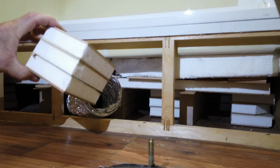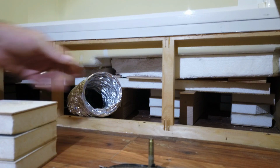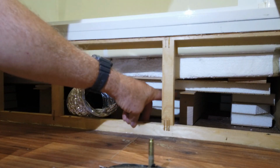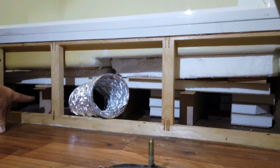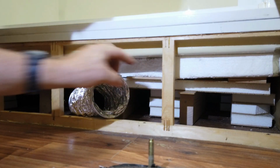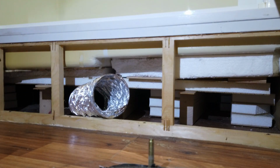I have taken out some of these stacks of styrofoam blocks that were under this platform, and replaced them with a 2x4 and a shim in 3 different places. You see there, there, and there. That greatly increased the support under the tub. And I also put a few shims in here to take up the gap of the compressed foam. So the tub feels pretty good.